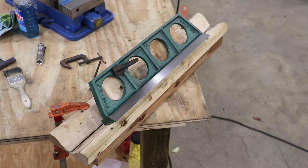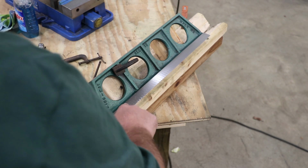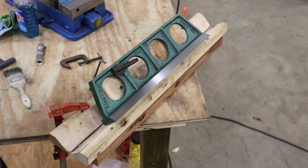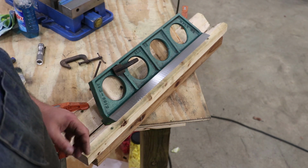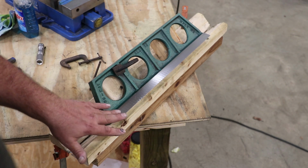So we're going to come in here, and I'm probably not going to show all this just simply because you've seen the process. We'll start off with making fairly long strokes and doing crosses. Again, this has been ground in, so it should be pretty close. We'll blue it up and just go through the same steps that we did before until we get our area of contact that we're looking for over here.